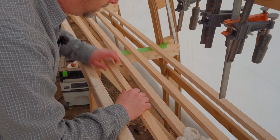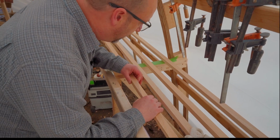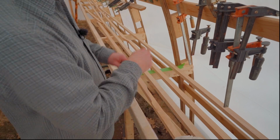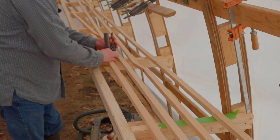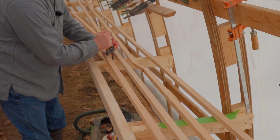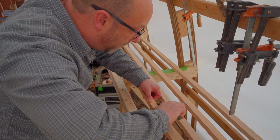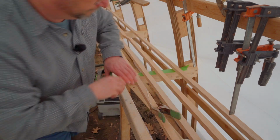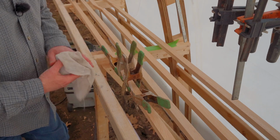The key for making this work well is to get these pieces lined up front to back where the scarves are going to be overlapping where I want. But before I clamp this, I take a clamp downstream and go ahead and get that locked in place. And what that allows me to do is put pressure right here on these two ramps and not have them spread apart. I'm only concerning myself really with making the top edge of this flush.